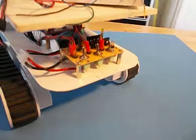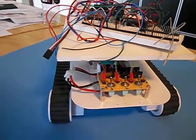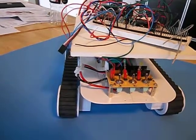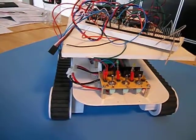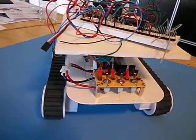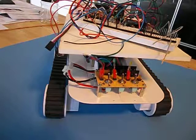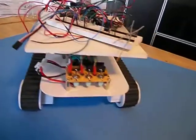On the back we have a power supply control board. It allows us to turn on a 7.2-volt power pack inside the robot base. We also have a regulated 5-volt supply using the 7805 regulator to provide 5 volts for the motor control unit and anything else on board. There's another 7.2-volt battery pack designed for an RC car that provides voltage for the motors, separate on the switch.